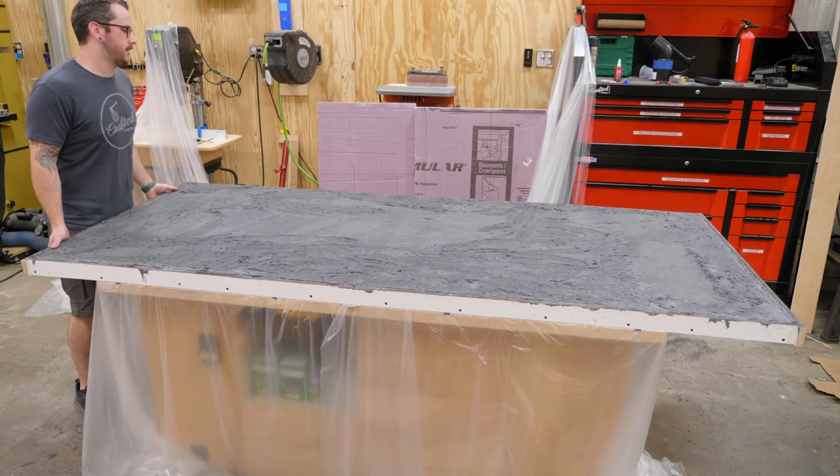One thing you might notice is that the tabletop actually started to sag — I think because it wasn't even close to fully cured — so I ran inside and grabbed some 2x4s to throw under the top to support it. Once the top was up on the 2x4s it flattened back out, but you definitely want to support it in the middle while it's curing. Next it was time to polish the top, which helped even out the color and smoothed out the transitions around the edges. For some reason I decided to start with the lowest grit in my set of diamond polishing pads — 50 grit — and this was way too low considering how smooth the top was already. Those 50-grit scratches were a real pain to get out. In retrospect I probably would have started with a 200-grit pad.